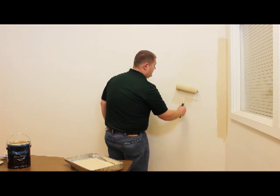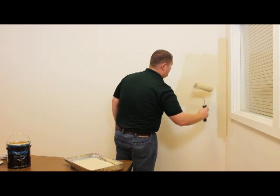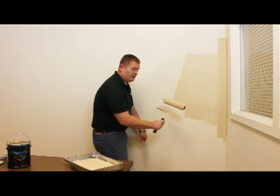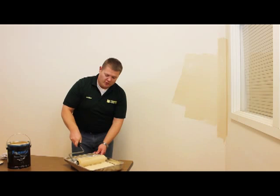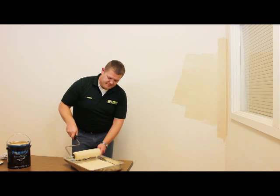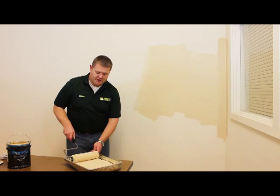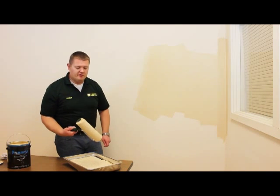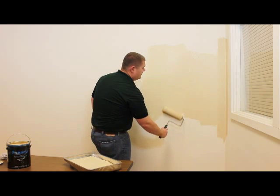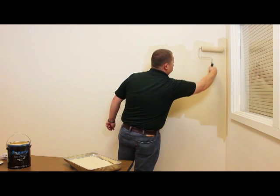Make sure you let the roller do the work. When I start running out of paint, I don't want to press hard — I want to go ahead and put more paint on the roller. One of the reasons you want to make sure there's plenty of paint on your roller at all times is that once you go over what you've painted before, you can roll the paint off. If your roller is too dry, it will actually pull the paint off of the painted surface.